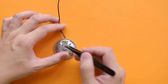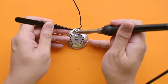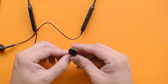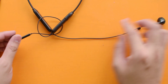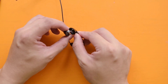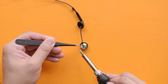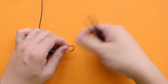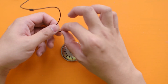Now that the first driver is desoldered, we move on to the second one — same process: unsecure the cable, take note of wire positioning, apply a bit of flux, hold the cable with my forceps, then touch the solder joints briefly to desolder it. We're now halfway there. We then take apart the original earbuds for the Bluetooth earphones. I take note of which side is left and which is right — disassembling was as easy as just pulling them apart. I apply flux onto the joints, hold the wires with my forceps, then desolder them. I undo the knot that was there to prevent tugging on the solder joints, then slide the original housing off.